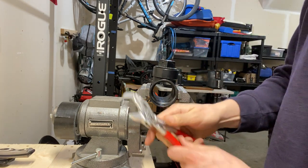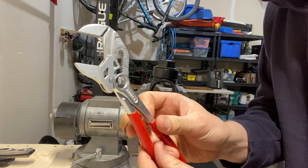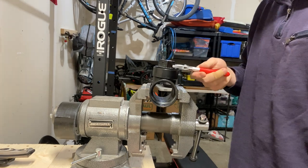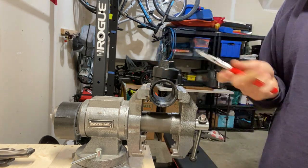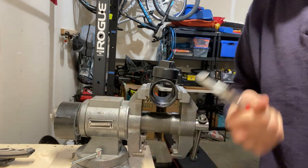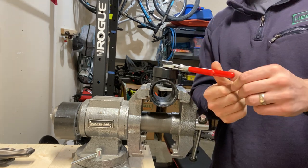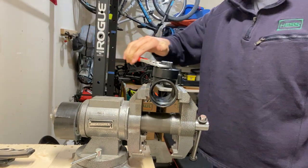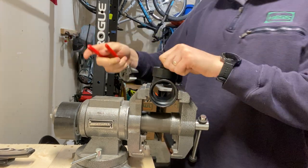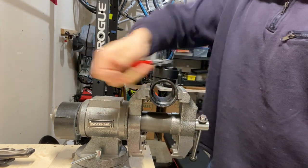You're looking at the plier wrenches thinking you can take on anything — it doesn't look too big, but I'm maxed out on the plier wrenches right now and it just barely fits on there. Here's the beauty of it: I can get a lot of torque on it. With a normal crescent wrench you'd have to squeeze to get the torque, but with something like this you just get it on there and tighten it right down. Easy as cake — this two inch square fitting is the maximum for the plier wrenches.